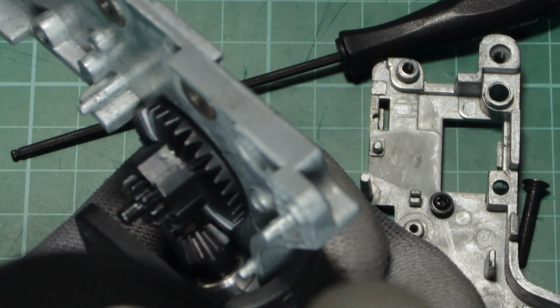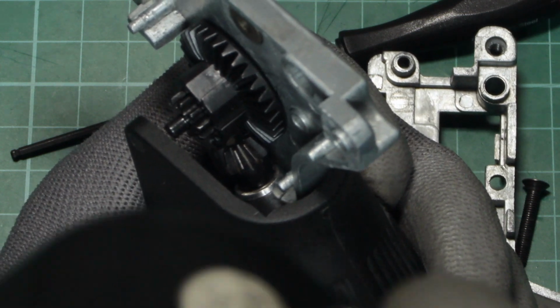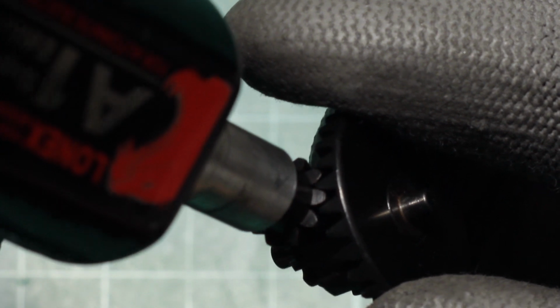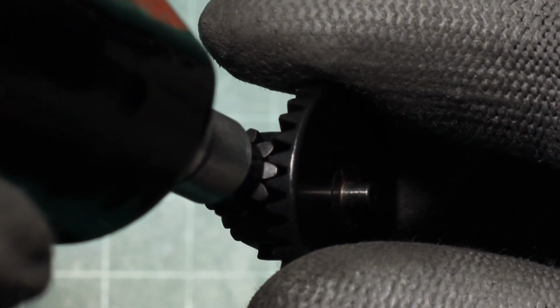Adjust the motor height with the goal of having the base of the pinion gear teeth sit flush with the bevel gear, while preventing the bevel gear from bottoming out. The test fitting revealed that this specific combination of parts that I had on hand would bottom out without the base of the pinion gear teeth sitting flush with the bevel gear teeth.